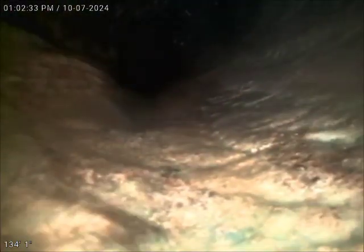We're out approximately 140 feet looking at the city sewer. That is 6-inch concrete. And here we can see the liner. This is 6-inch PVC. Another company put this liner in, and I did see some spots along the way where there is some bulging in the liner, which is abnormal.